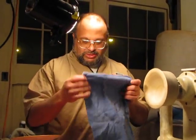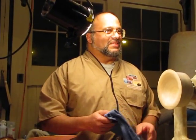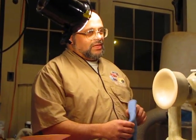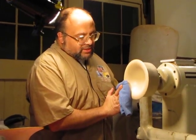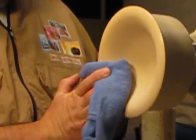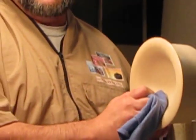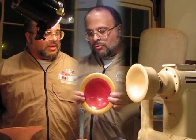I don't know where you're going to get this rag — my father always goes to auctions and brought back a big box of them about 20 years ago, and I still haven't gone through all of them. It's some synthetic cotton mix and it works really well for buffing. I think if you went to the store and got one of those shop towels, it would work just as well. Now I'm going to buff this up. The idea here is two things when I'm going to paint: I want the wood surface to be slightly sealed by the buffing so it won't take the paint as much, and I also want this to have a really nice finish because I'm not going to have a nice finish on my paint if I don't have a nice finish underneath.